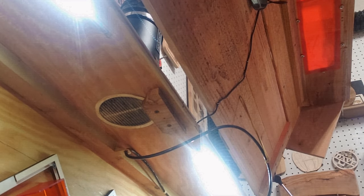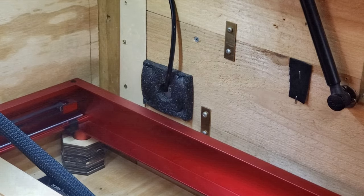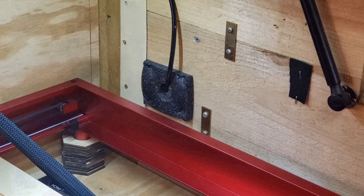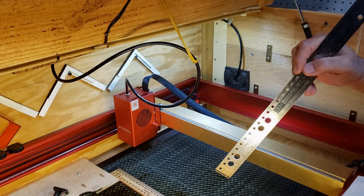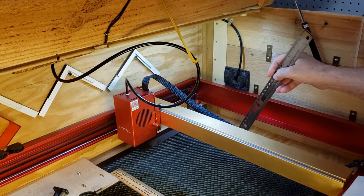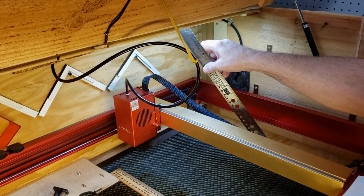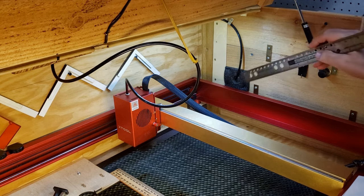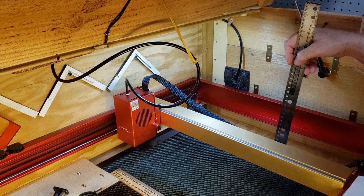I've got sewing lights inside the top of the enclosure — just two strips and it's plenty of light. I didn't even know what sewing lights were until I started building this enclosure; they work really well and I'll leave a link in the description. I cut a hole in the back right corner to run cables through, which also assists with airflow — you want your exhaust fan to create some vacuum to pull smoke out, but not too much. The full dimensions of the enclosure are two feet by four feet by eighteen inches high. The base under the honeycomb is three-quarter-inch plywood, the back is half-inch plywood, and I've got guides so I can just slip the lid in and out with screws on the outside.